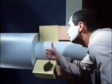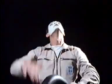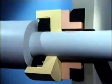Here the seal is perfect, but here and here we still have a leakage path. Of course — instead of one sealing gap, there are now three. No wonder there's a drip. Because seal and seal face rotate at the same speed, they don't move in relation to each other. Between the housing and the stationary seal face, there is also no movement. And if nothing moves, sealing is no problem. Secondary seals are used.